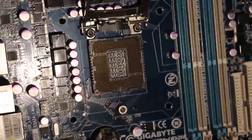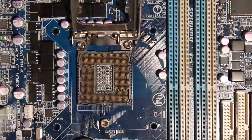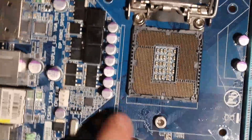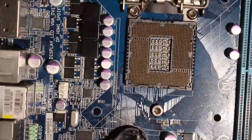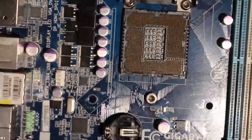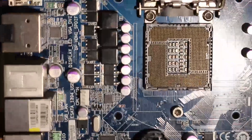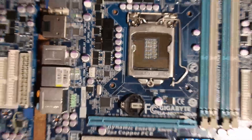Anyways, let's get this in here to show you the board. I think that's my original one — it started misbehaving again once I took it out for testing, because that's just what these boards do. Anyways, there is a bunch of little SMD resistors here and you want to remove the fourth from the bottom and replace it with a zero ohm one, or just a solder bridge or a wire.